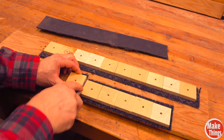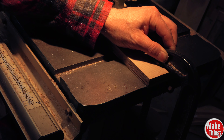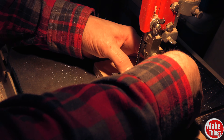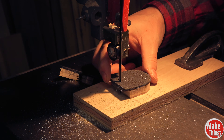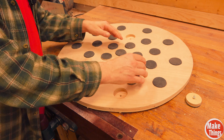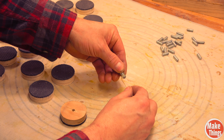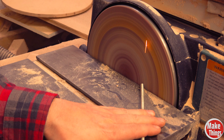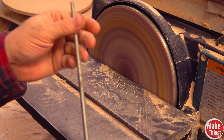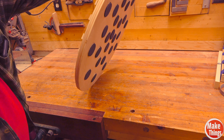With these cut, I put my circle cutting jig on my bandsaw and held it down with the clamp. I easily inserted each block onto the bolts and spun, cutting my blocks down to circles so that they easily fit in my finish table. With the hole in the circle, I epoxied a cone-shaped threaded rod that you can easily make with your sander. What's nice about the finish table is that these quarter inch bolts fit inside the holes we drilled earlier, so lifting it onto its side and storing it keeps the pads from falling out.